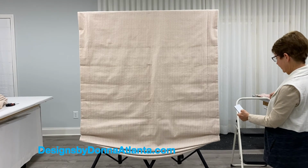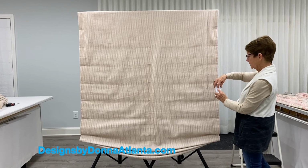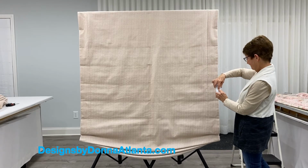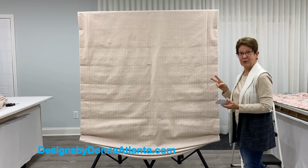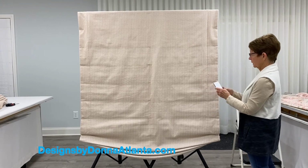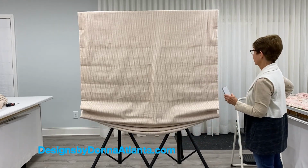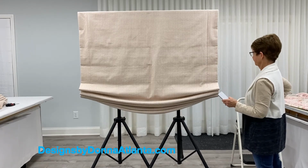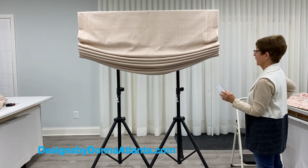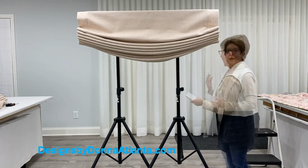All right, I'm going to say that is my lowermost position. I'm going to press the stop and the down button at the same time. I got my 2 jogs and 3 beeps. I now have a lowermost position. I can now send the shade with continuous travel by simply pressing the up or down button. I'm going to send it to the uppermost position. And I can stop it anywhere in between just by pressing the stop button. So there's my uppermost position. Now upper and lower limit set.